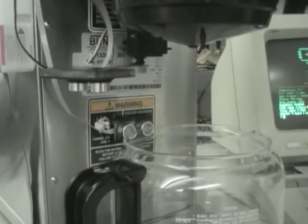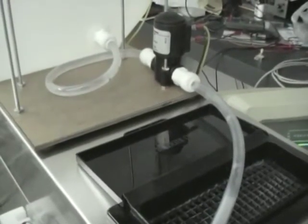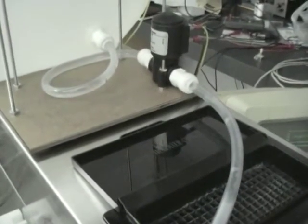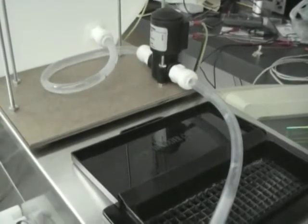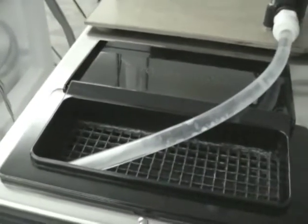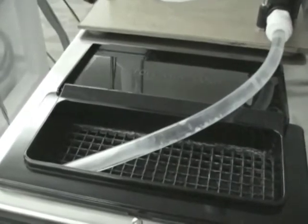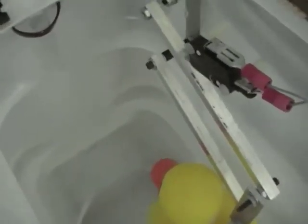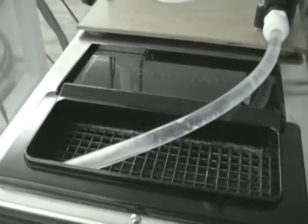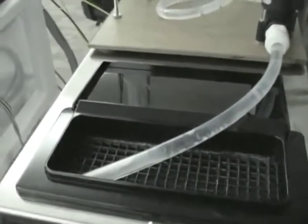So the head reads the fill level and then docks itself safely out of the way for water to flow through. In a second, it will send its results back to Pot Sticker, and then Pot Sticker will send its data to Baron, so it may determine how much water is going to be dispensed, and then request that amount from TankMan. TankMan will then open the release solenoid valve, which will begin to drain the intermediary tank. Once the tank begins draining, the rubber duck inside the tank will begin to lower down. We then use a time differential to calculate how much water has been dispensed, and after that amount has been dispensed, the tank automatically refills.